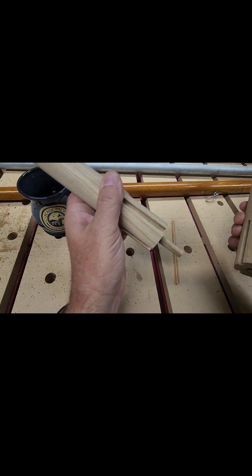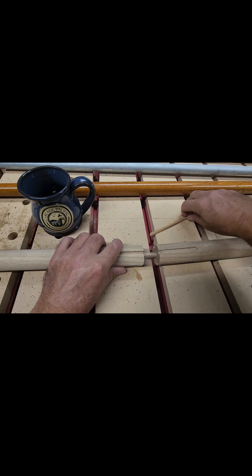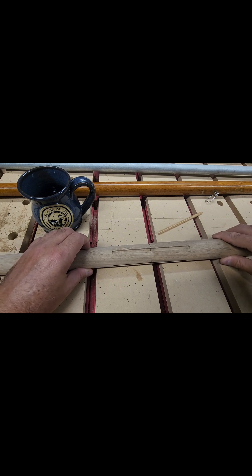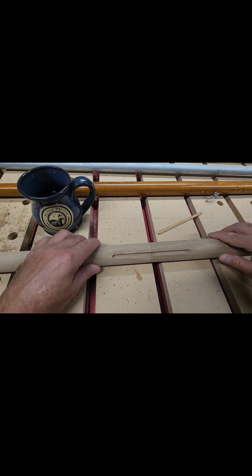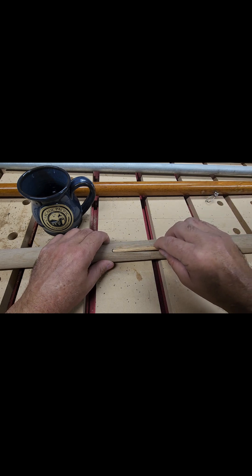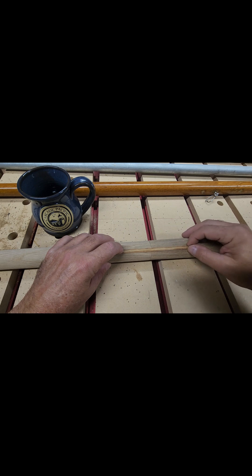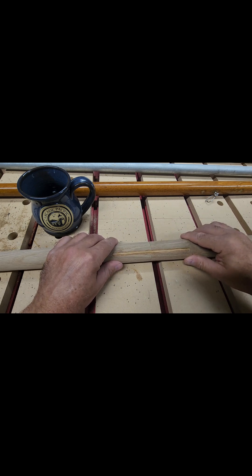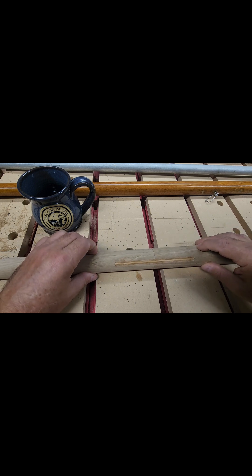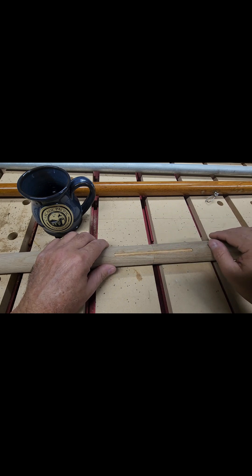Here's how this all gets put together. This slides into here — all cut from a single piece of wood — and the grain is meant to match. There we go, that lines up from top to bottom. Then we're going to fasten our spline, which fits perfectly in this slot, and we'll do that around the whole circumference of this piece. The goal is to end up with a beautiful looking joint that will really stand out once we get a nice varnish finish on it.